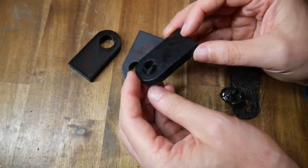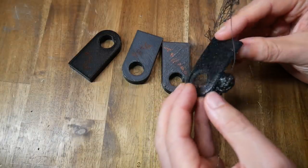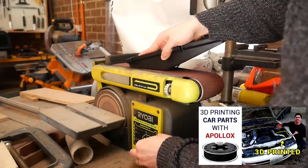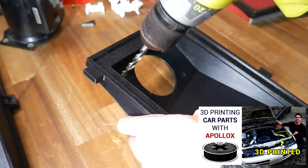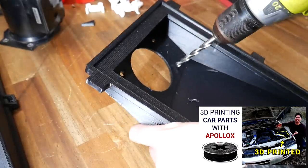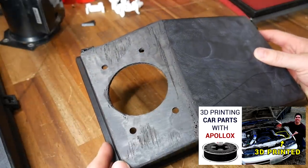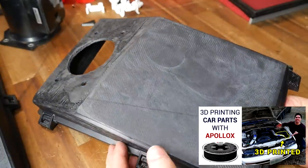And finally nylon, which warped off the bed and came loose, which is why I'm hoping the other filaments provide a better solution. Previously when working with Apollo X, I found I could belt sand the surface without it overheating and melting into a mess. I was also able to drill through it, again without anything melting, unlike PLA which does this occasionally. With Apollo X, my sanding worked through the outside perimeters, but apart from that the plastic didn't melt and held its shape — so that's what I'll be testing for with my samples.